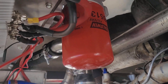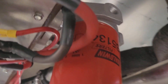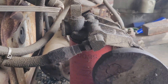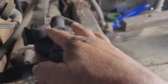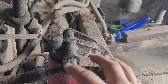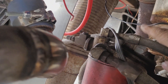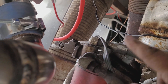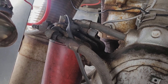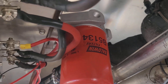The next task is to figure out the best routing. A 180 won't work here — it's too tight. These housings are the same as used for fuel filters, so the inlet can be either the top or this fitting here, which is just plugged. The outlet fittings are on the sides. In this case I only need one outlet, so I'm going to go in the top and 90 out of it, then plug the front.